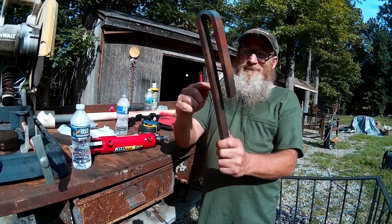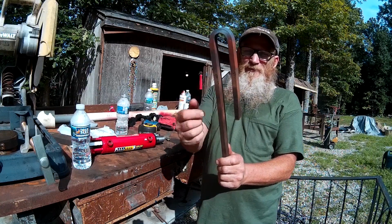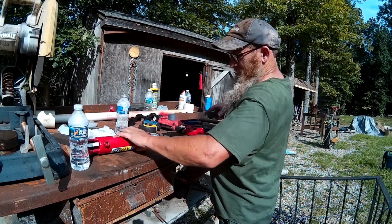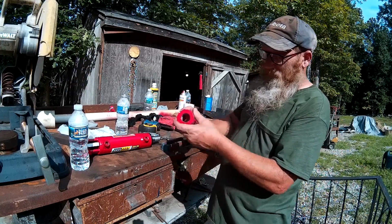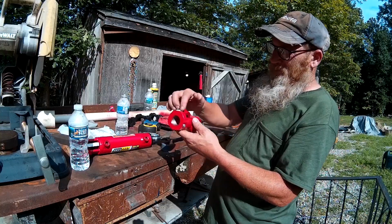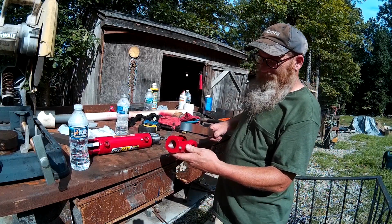We're gonna whack this off, of course, and we got to bore a hole through this thing all the way through both sides so we can put the pin through. But this is going to mount on this end of this. This is what came on the end of here, and it screws up on there. So what I'm thinking is that we'll chuck this up in the lathe and maybe machine this off, or saw this off and then weld this to it.